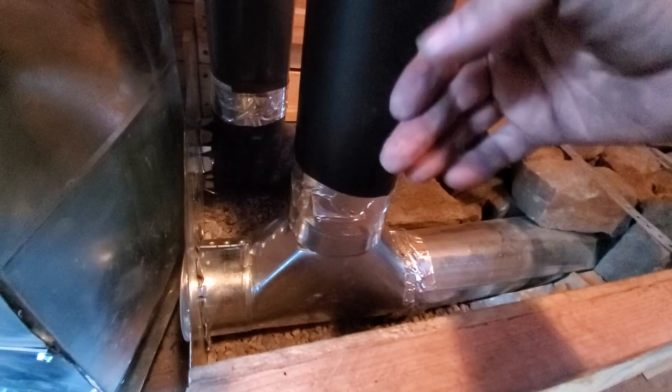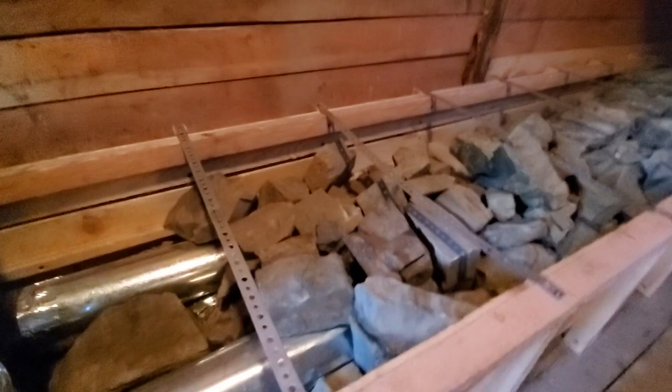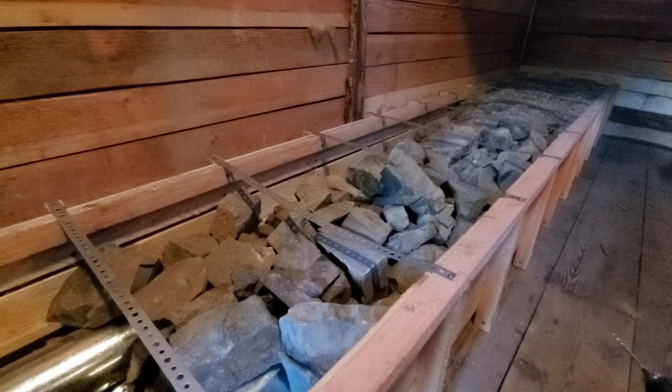Still cool to the touch — I've been burning this for about an hour. But this pipe is nice and hot. The pipes go through pea gravel surrounding a stack of this really dense local rock. That rock stores up the heat and slowly releases it, and the pea gravel acts as a little bit of an insulator.